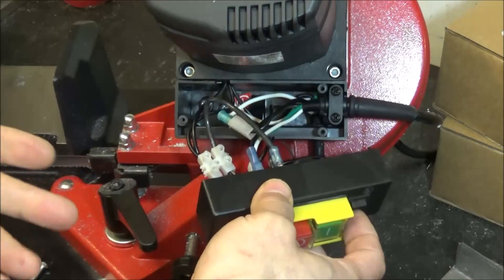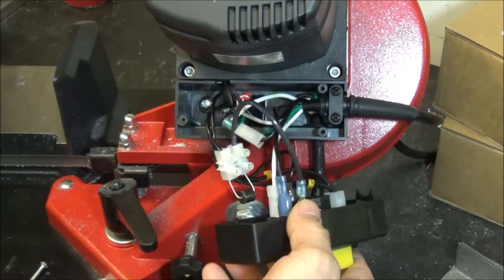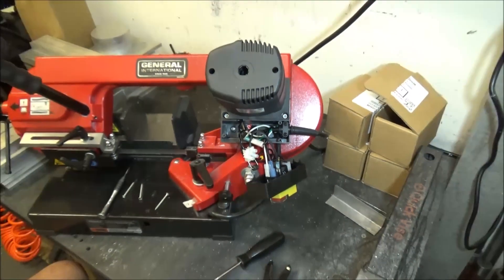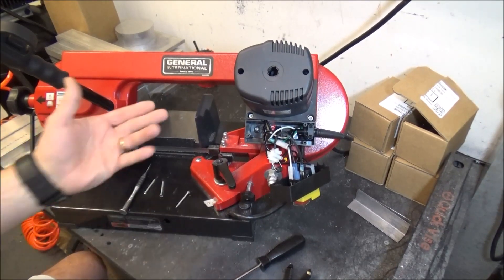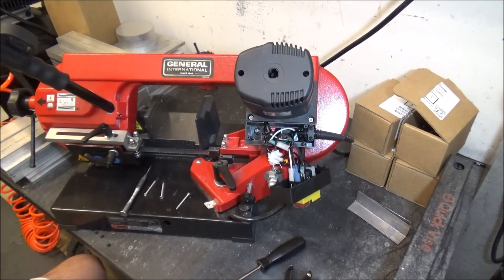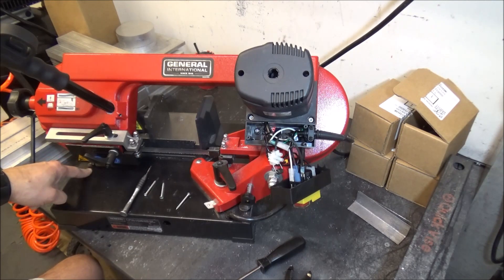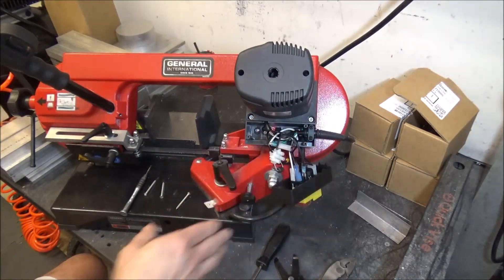I can physically hear and feel it clicking — the internal relay. So now when I lift the saw it's not going to come back on. I tried it the other way and it seemed to work fine for me, but there were a few occasions where I lifted the saw, forgot to turn it off, and it came back on. This is probably the safest method. If you're going to run any kind of coolant with this little saw, be mindful of this switch since you've got electricity running down in the bottom — you don't want anything wet under there. I'll button this back up and we'll get a good look at how it operates.